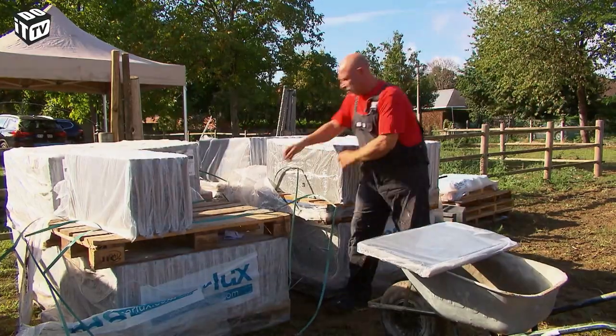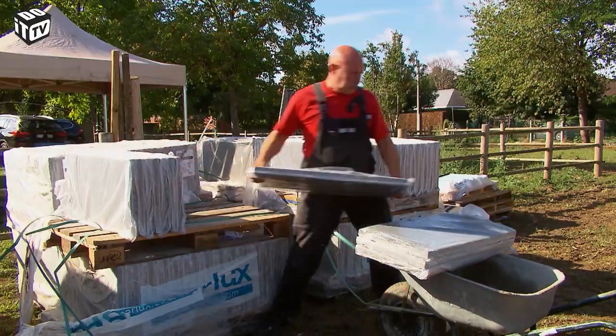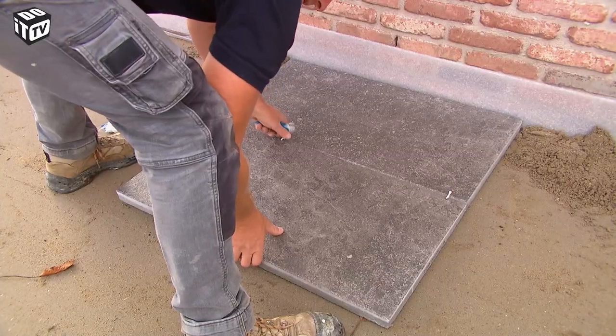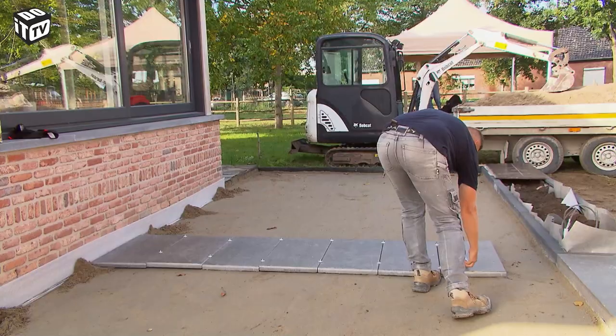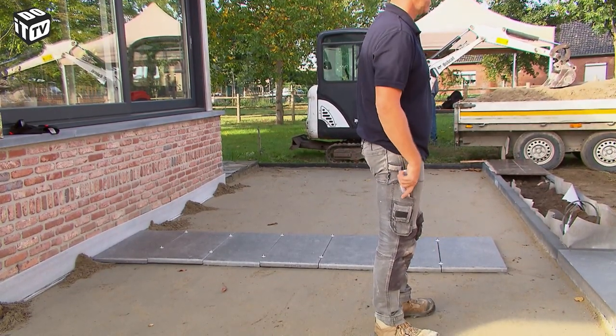When you are ready to start, take your tiles and gently mix between the various packages. First, lay out a row in both width and length so you can check if you will end up well. Roger must shorten his tiles along the house's protrusion. For that, he doesn't start his first row there, as usual, but on the opposite side, since cut tiles are less noticeable on the house side.